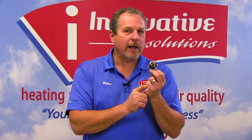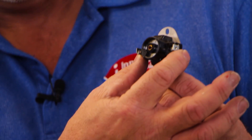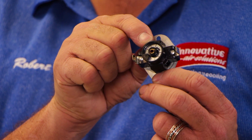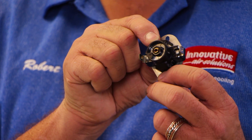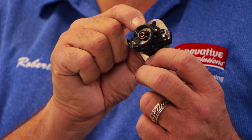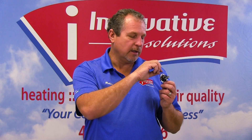This will break the transformer power that we have. The 24 volt power will always be wired in series. This particular adjustable limit has two terminals on either side. On the inside we have a dial with an adjustment — this is for temperature. We can adjust this to a range of different temperature options. Make sure yours is set for the same temperature rating that the one you're pulling out is rated for.